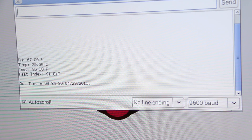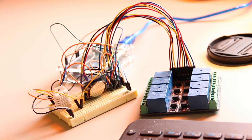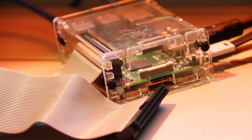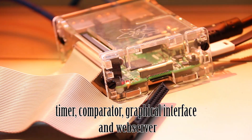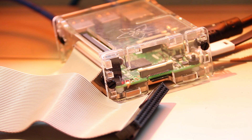So this controller — the Arduino is going to work more or less as a PLC. It does some simple math, takes data in from the sensors, out to the controllers and relays, and does the heavy lifting. It can run via USB to any computer. The plan is for the Raspberry Pi to be the controller — that will say, lights on at this time, off at that time, fan on at this relative humidity, off at that humidity, and so on.